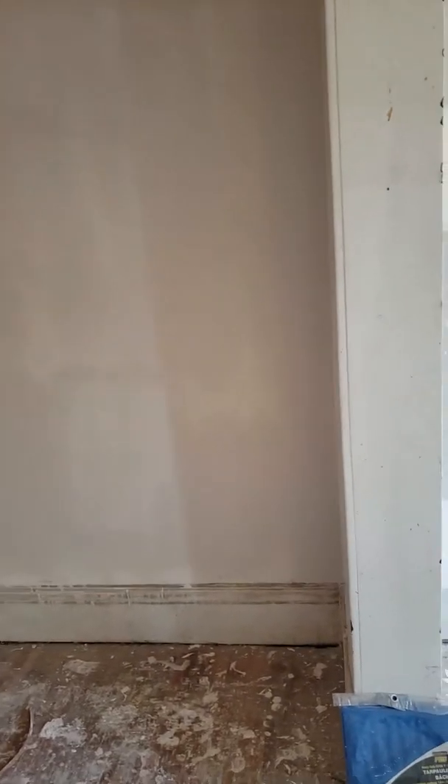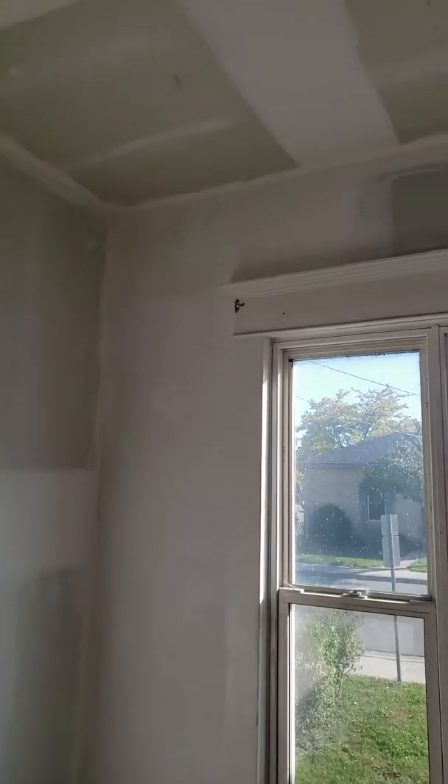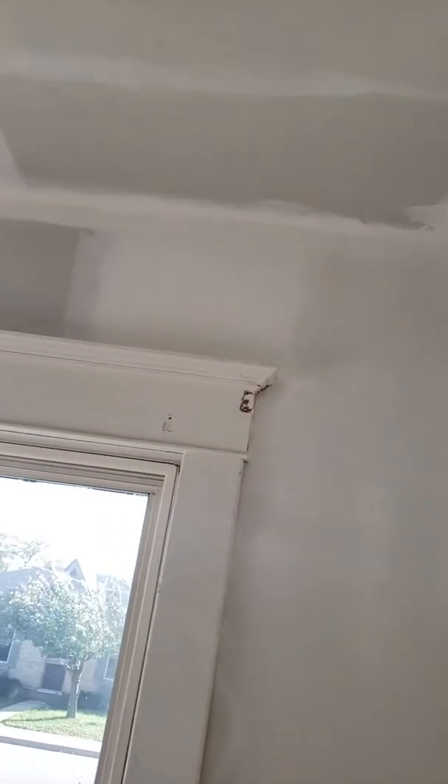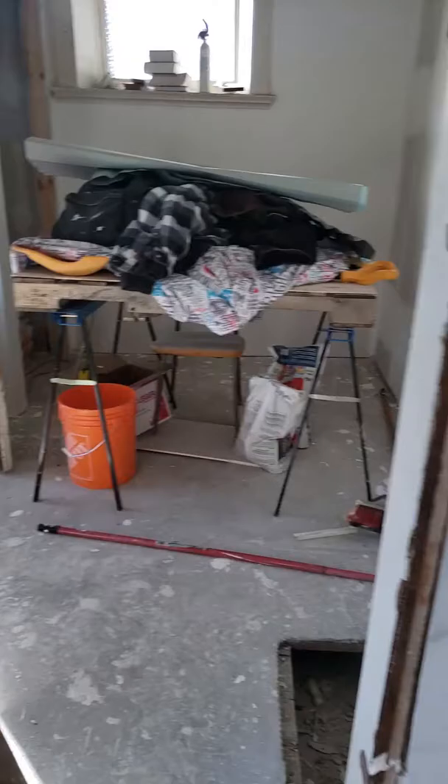We're on day number three — it's all taped and loaded. I didn't do any of the new drywall stuff; I'm trying to get the first coat on before I touch anything else. I have to pre-sand everything once all the first coats are on and then start finish coating. This whole wall is all skimmed out, nice and very clean. I had to take those sheets down off the windows — I'll put those two pieces of drywall up in front, fits perfect so nobody can see in. But I needed some natural light because I couldn't see my trowel lines. The most important thing is having these perfect little lips — they're very easy to sand out. No indents, no cuts, just very small lips roughly every six to eight inches.